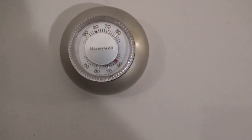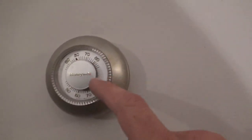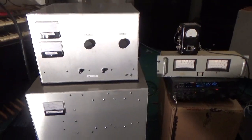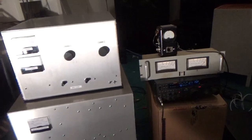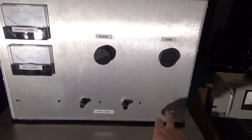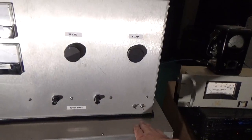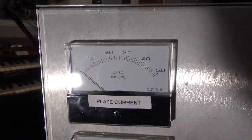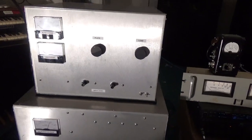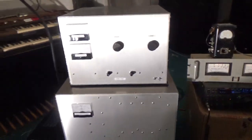I am so glad this is done, and it is so hot in here. I'll show you — there's the temp, it's hot. Hey, I don't have AC down here so I am very sweaty. Thank you all for staying tuned and keeping up with all this. I want to show one other thing. This is the standby-operate switch, and this controls the static plate current. In one setting it's about 50 milliamps. Unkey it — just under 200 right there. So we can go from one to the other. I am so happy this is done.